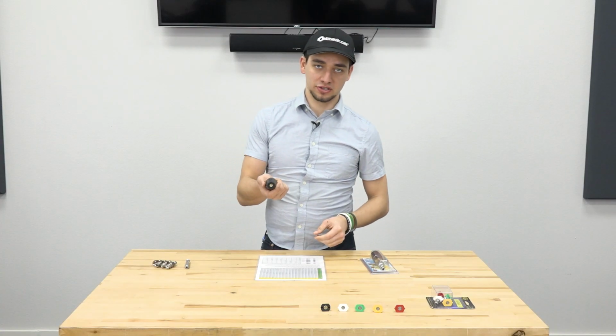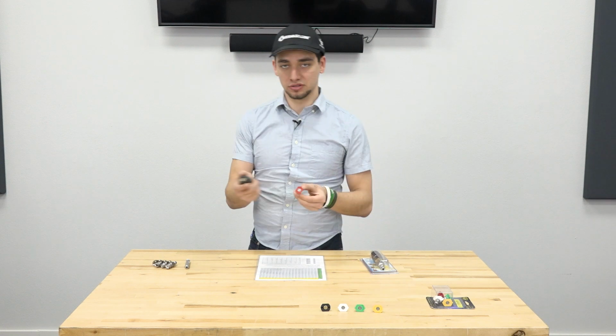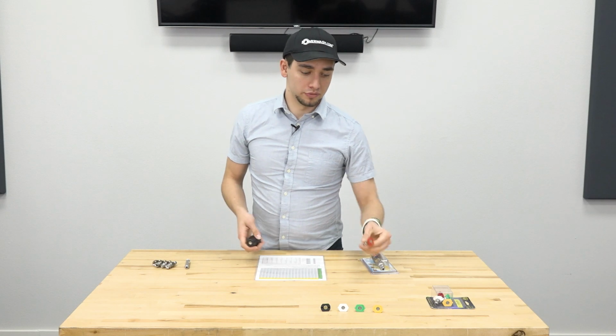I'm going to talk a little bit about some of these specialty nozzles, like these turbo nozzles or this M5 twist that you would see on an X-Jet. This one's just like a 0 degree tip, like the red one for the quick connect, except it bounces around so you get more area of spray. If you're doing concrete or curbsides, it makes it easier than standing there going back and forth with the nozzle. It's a lot more helpful.